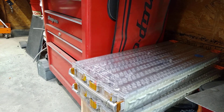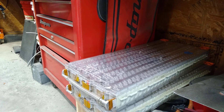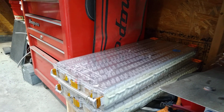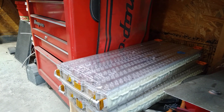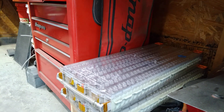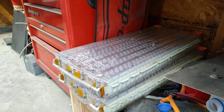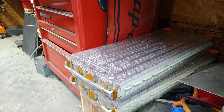I bring that up for anybody watching: if you have an off-grid house or cabin charging your batteries off solar, and you think you want to use these Tesla modules — they are okay, they're not going to just self-combust — but if you don't get your charge currents correct on your charge controller, it's catastrophic. A friend of mine went from lead-acid batteries to a couple of these, and unfortunately he didn't know he needed to change his charging characteristics from 56 volts down to 49.2. That's just catastrophic.